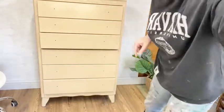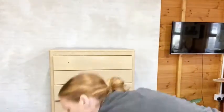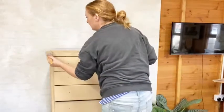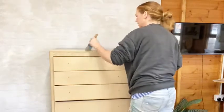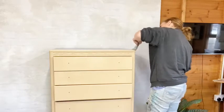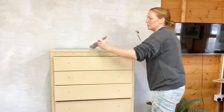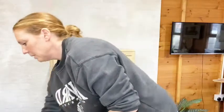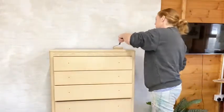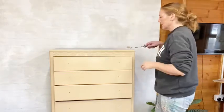I haven't done the top yet - let's get the top. Let's see where we are with the dryness. I've got a little extra dribble going on there - let's just grab that. I do this bit first and then roll up so that I haven't got to worry about getting into that edge and messing with my finish on the top. Load the roller up a little bit - I just want to get the paint on relatively quickly so I can then sort out my finish.